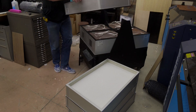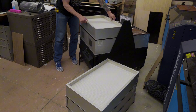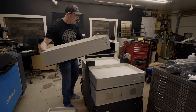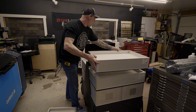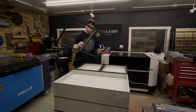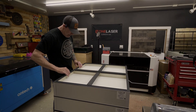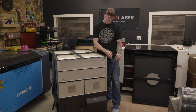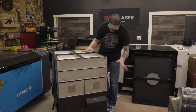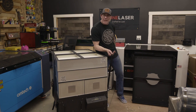Simply bring the HEPA air filter over and drop it on top of your gas filters — it can only fit in one way. Next up is cartridge number one, the pre-filter cartridge. Go ahead and place number one on top of number two. You should have removed two of these in the disassembly process, so place those back on top. Pro tip: when stacking your cartridges, make sure these straps are dangling off to the side and not pinched anywhere. Make sure everything is nice, square, and perfectly level. Then we'll get the hood put on top and I'll show you how to put the safety straps on the side.